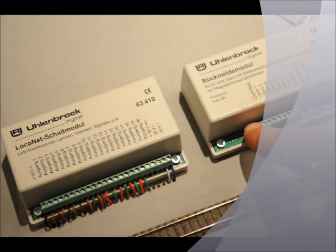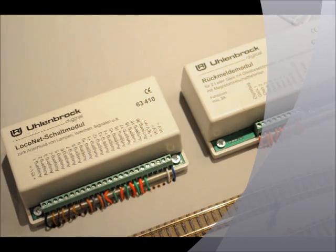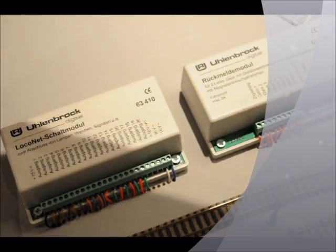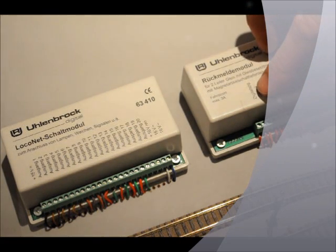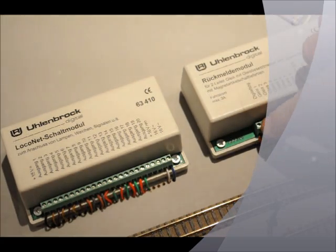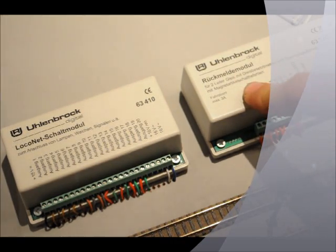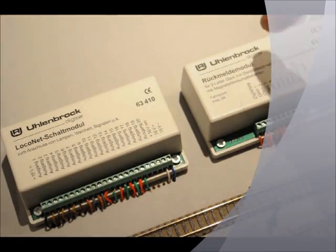The first output here — this wire is the feed from the IntelliBox track power outlet. If you plug that into output three in the back of the IntelliBox, that wire from three comes to what it says on here: digital SPG, so that's the digital input. So that's the first output. That wire with all your feedback modules has to then loop to each of the other feedback modules, because that gives a digital signal from the IntelliBox to the module.